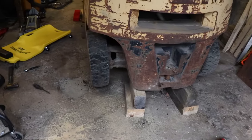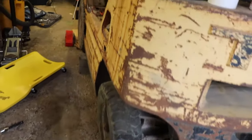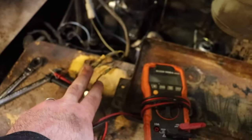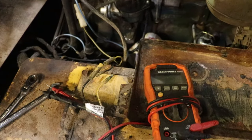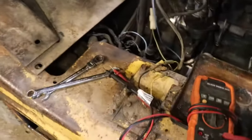Today we're going to take the wheels off the machine. I tried to empty the fuel tank. I took a measurement of the resistance across here, and it was 86 ohms. The empty level is 80 ohms plus or minus 10, so I know that the tank is essentially empty and the fuel gauge could be reading correctly.